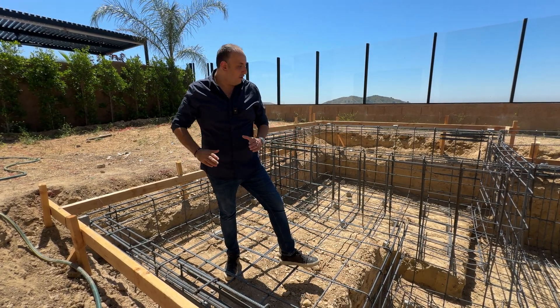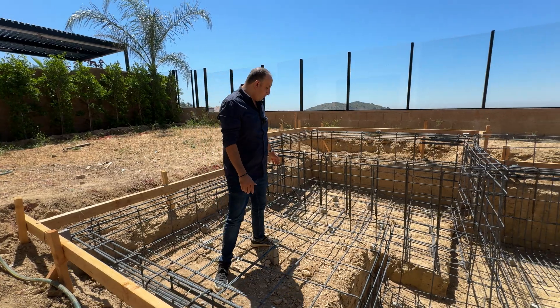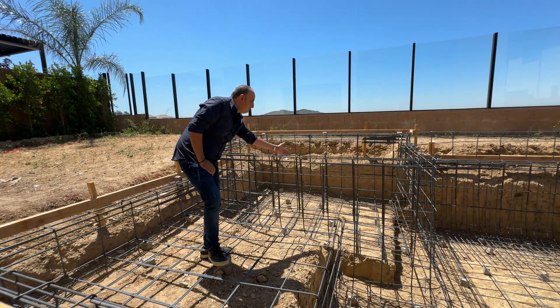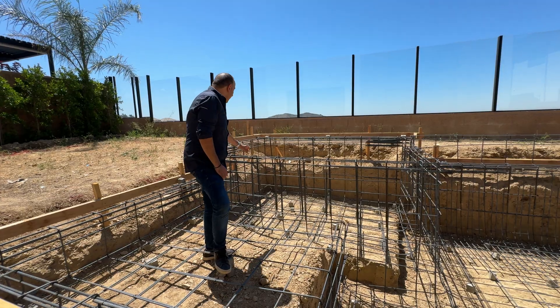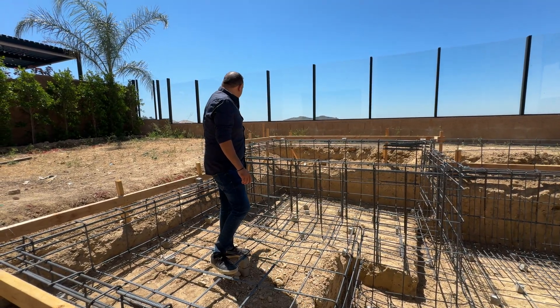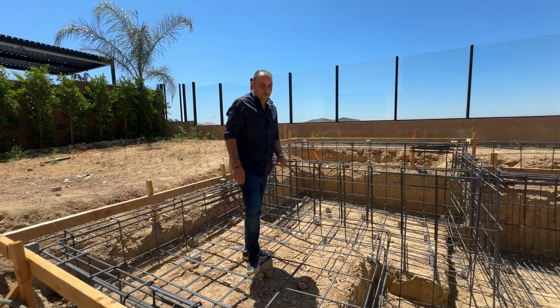The engineer gave us a schedule of how to do it. If you look at this portion right here — my spa wall — you can see I have my rebars every one foot, scheduled out. And again, we have the same bond beam, six rebars on top that continues all around this beautiful pool.